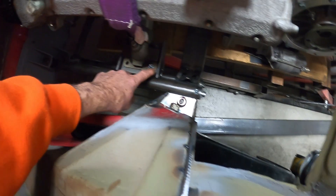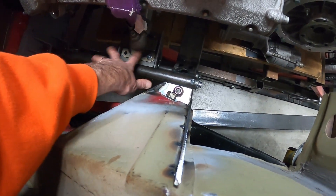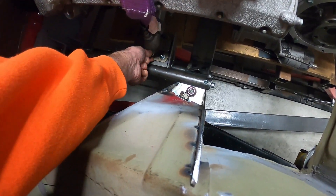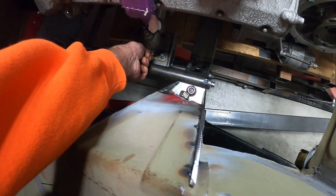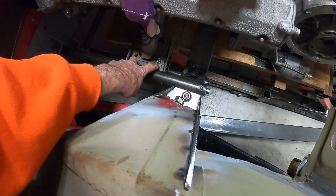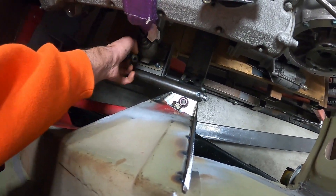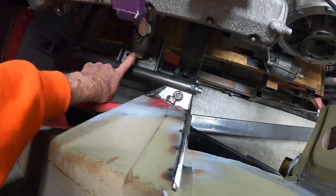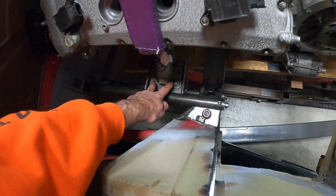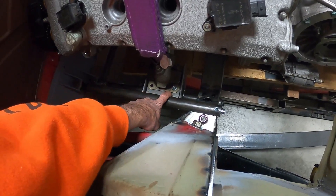So this plate is going to replace this lower section. We're going to take the whole mount out and that plate will fit here. Then we're going to make up a spacer to take up this distance after measuring carefully, so that when we fixture this all together and bolt it back in, the top plate for the motor mount will be dead parallel to the base — which is what we want. The spacer is just a fixture to get this plate located correctly, not for running.